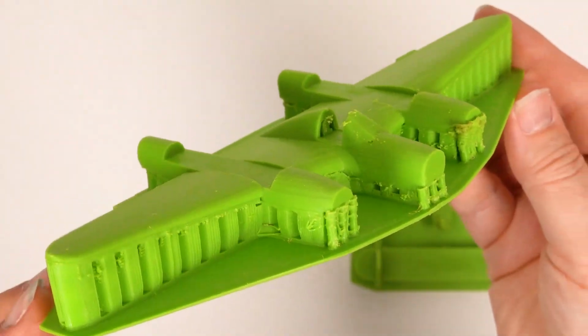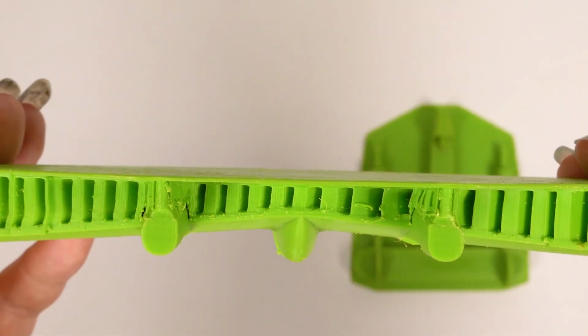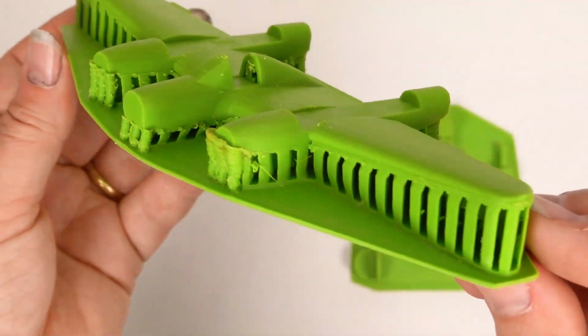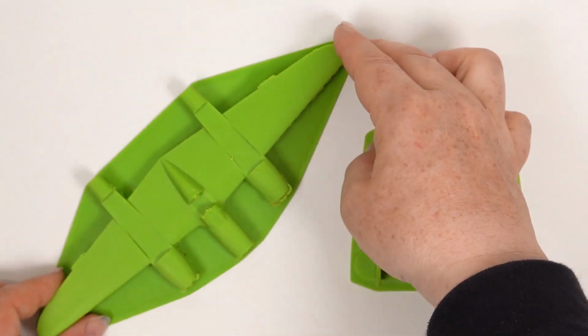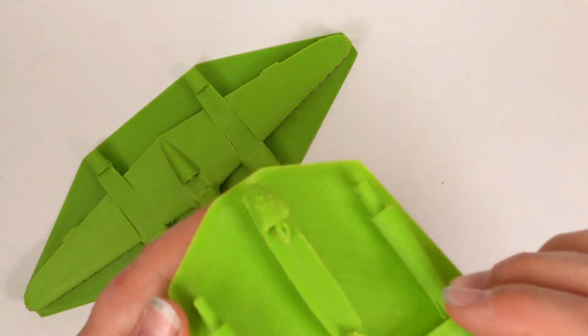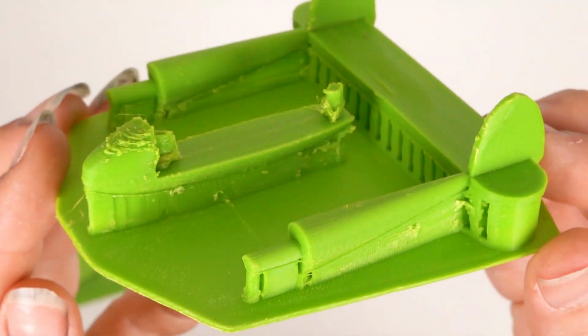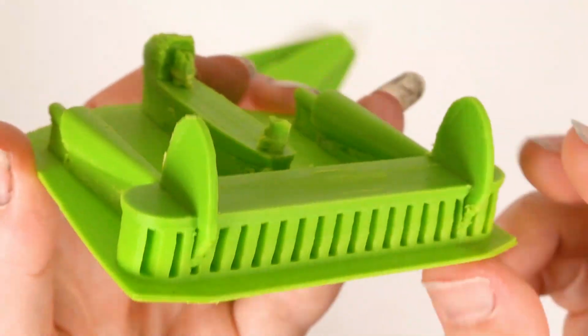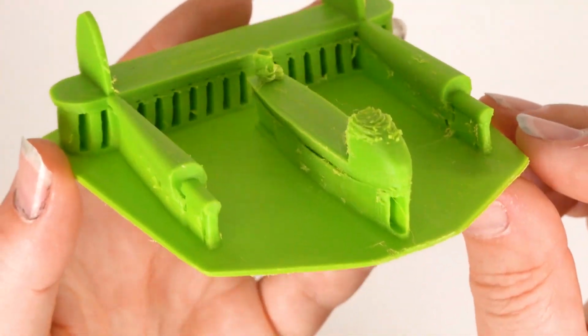They are a bit blobby due to over-extrusion, but it does make the parts solid and without voids, which is crucial. You can clearly see the layer lines here. Each layer is 0.1mm high. I used a 0.4mm nozzle, which is a standard size. I deliberately printed these parts thicker to allow for filing out these lines, so everything should come out spot on. It looks a lot worse than it actually is.